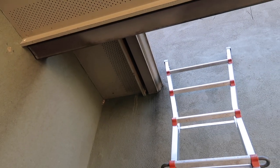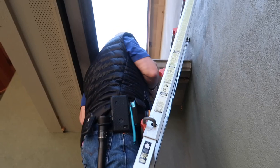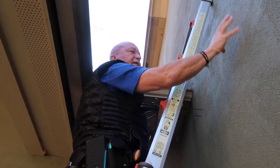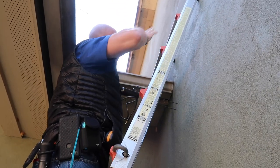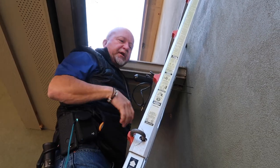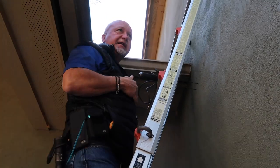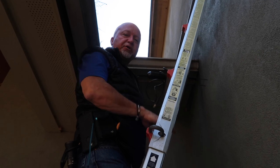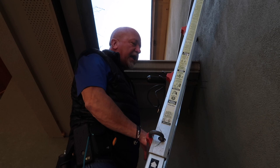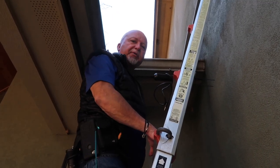Back of the soffit area. We chose this location. The reason why we're picking this location is because the stucco is extending above the roof line and there's missing kickout flashing in this location. Since we've already been in the attic in this area, we know that there is moisture getting through the stucco because we have some wood rot in the attic. So what we're going to do now is drill this location and just verify how wet it is or if the substrate's in good shape.